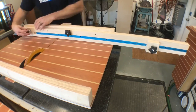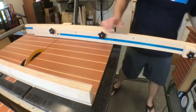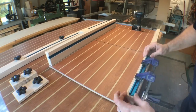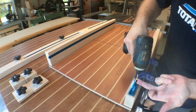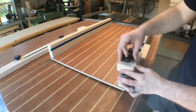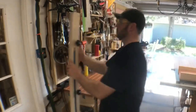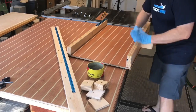The build is just about complete. Testing it out, I have the capacity to make repeatable cuts up to five or five and a half feet in length — and quite frankly, for a crosscut sled that's pretty awesome. I'm really happy with how this turned out. To keep those stop blocks close at hand, I've installed the last piece of T-track on the far side of the back fence, giving me a nice area to keep these stop blocks stored nice and tight. For storage of the long auxiliary fence, an eye bolt in the side and a screw in the wall works as good a place as any. I finish up with a coat of paste wax over the entire sled.